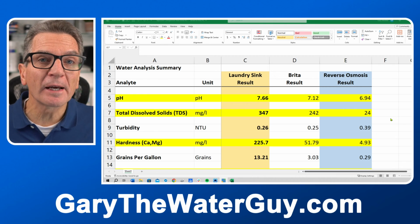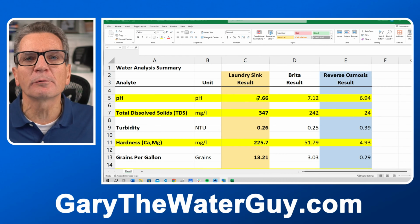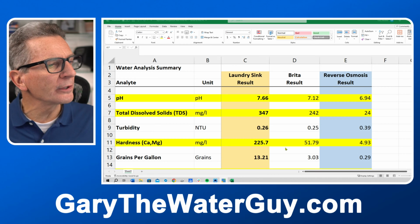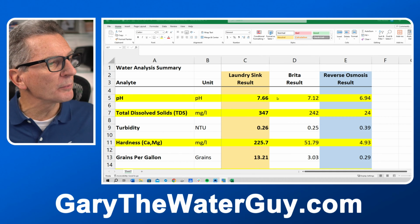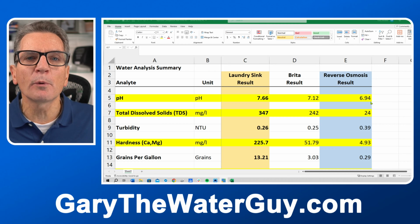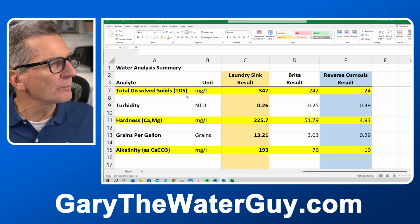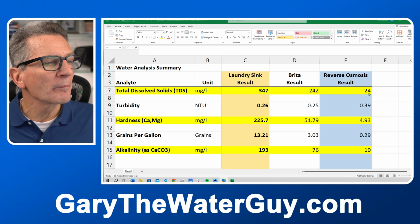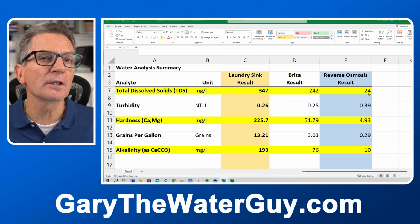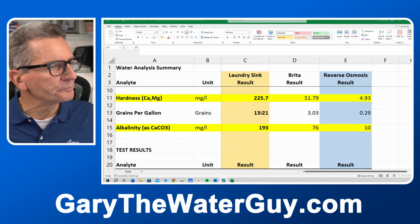So we received the results back from TapScore, and I put it on this spreadsheet so we can check them out here. So laundry sink result, that's our raw water. Brita result, that's after it's gone through the Brita, and reverse osmosis result is after it's gone through a reverse osmosis system. So you can see here the pH went from a 7.66 down to 6.94 after the reverse osmosis, so dropped a little bit going through the Brita, but not as much. The total dissolved solids dropped again somewhat going through the Brita, but it dropped significantly going through the reverse osmosis system, down by almost, actually a little bit more than 90%.